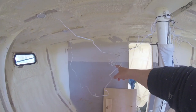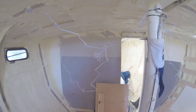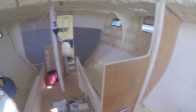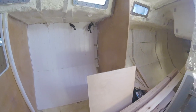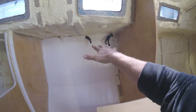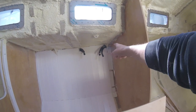I'm also going to put tongue groove cladding on that wall there — I just don't like solid colours. So the saloon is coming together really well. The galley frame has started getting painted up. There's the nav station, which is mostly done. You can see there are solid planks of ply behind the tongue groove, because there's a huge amount of stuff screwed to that wall, and tongue groove pine doesn't hold a screw as well as plywood.